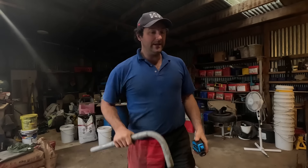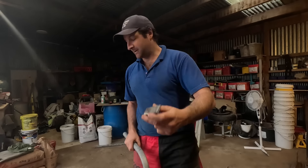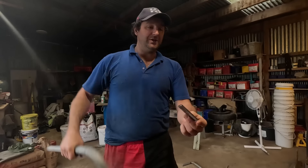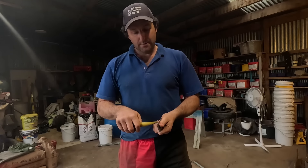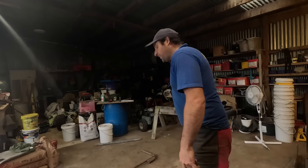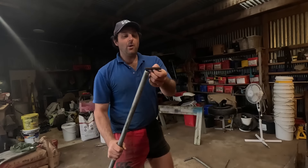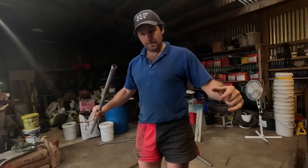The next piece for the handle - we've got our top handle piece, and then what we want to do is grab a piece of flat bar. These are actually just flat standards - you see them quite a lot here in New Zealand. The dimensions are 30 mil wide by five or six mil thick, and these pieces are about 75 mil long. Two of them - one will go up the top of your main pipe, one will go up the bottom - we'll weld those three pieces together.